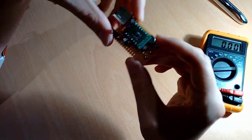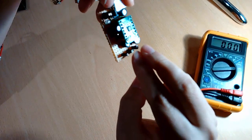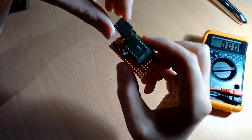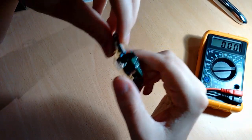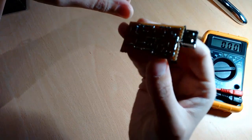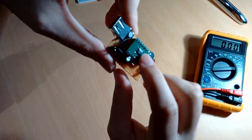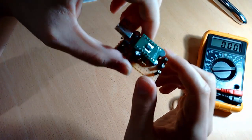Here I have a small circuit that can convert and stabilize the energy of thermoelectric generators to 5 volts. And then I have a USB connector that can power mobile phones and similar devices. Of course, this module needs much more than 20 millivolts in order to generate 5 volts, because it has an active component that needs at least 200 millivolts in order to start operating.